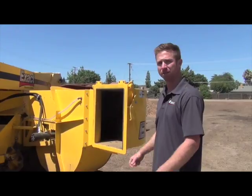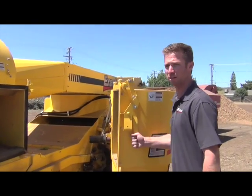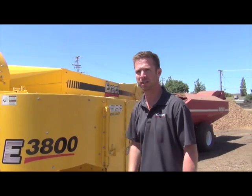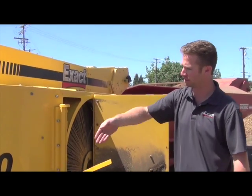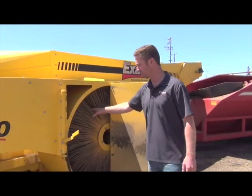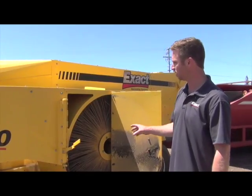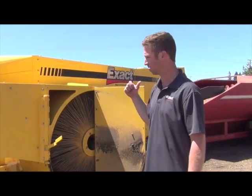So that's where we're getting our dust reduction — the majority of it. What we're doing is injecting water. We have a 185-gallon water tank on board above the rear axle here. We have five T-jet nozzles lined up right in here, spraying water — all that dust and junk going through there, wetting it down. And then these brushes are doing two things: they slow down the velocity of the air and then they allow that dust and water to mix up. They're rotating about 150 RPM, so it becomes self-cleaning. So the dirtier this thing is, the cleaner the exhaust is of the fan here.